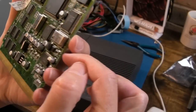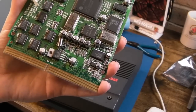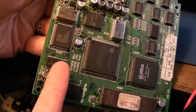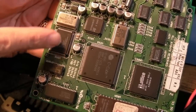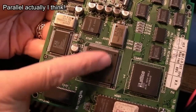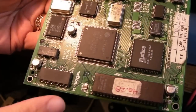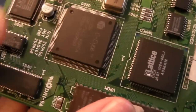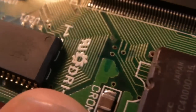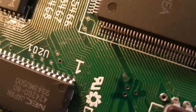There's a cracked cap on this board, which may indicate similar issues. I'll measure on resistance to see if one of them has turned into a resistor. Looking at the schematics, this is the RAM for the sound side - this is the sound decompressor, getting data via serial probably from the main MPEG chip. This I think is for the video side. I noticed this very early on: there is a green mark here - someone marked that to indicate an issue.